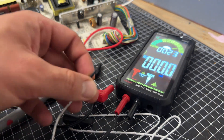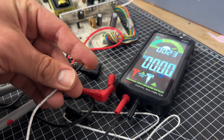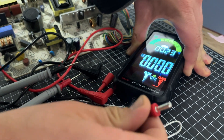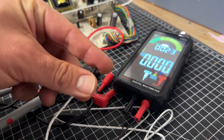This eliminates the scale compression found in analog meters, but requires a source of reference current. An auto-ranging digital multimeter can automatically adjust the scaling network to the measurement circuit used for precision of the analog-to-digital converter.